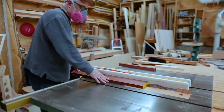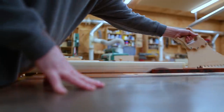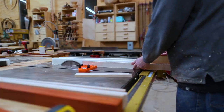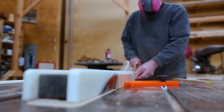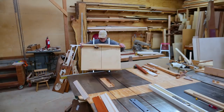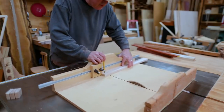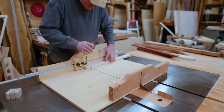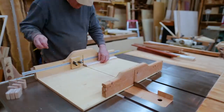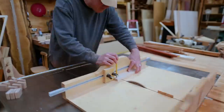For this one I wanted to use purpleheart and maple, so I get a red color and the lighter maple wood. I cut the strips at a 10-degree angle, then cut the strips into shorter pieces — about an inch and a half — and this determines the thickness of the inserts. With an inch and a half I'll have enough height to put these inserts into the curve of the bowl.